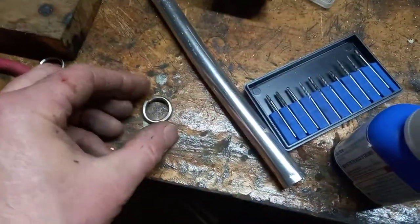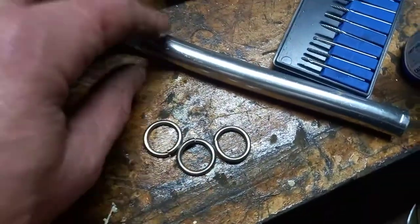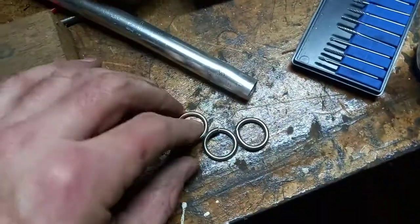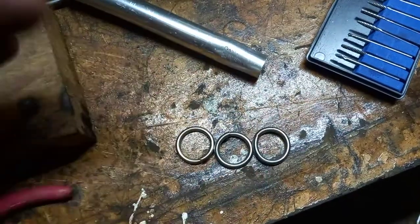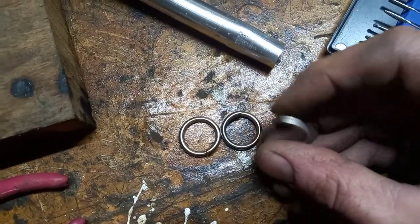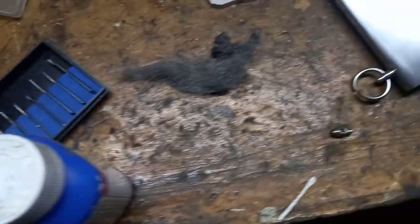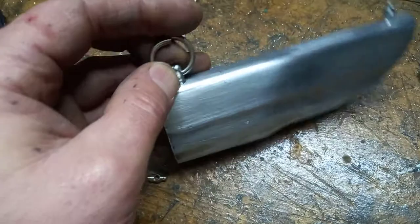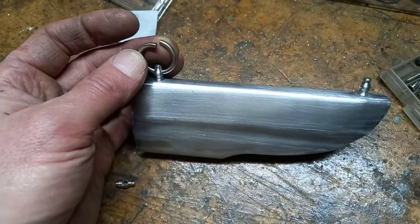I thought I'd share how you get the rings. I've used three millimeter stainless rod - three mil's a little bit overkill, you could do two and a half mil if you've got it. I use this little bit of aluminium tubing that I wrap the rod around. I don't even have to heat it to wrap it - basically spiral it around the tube, then cut it and you've got your rings. Just a little insight into the solution I came up with.